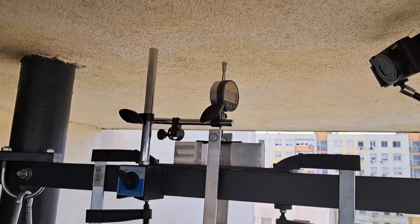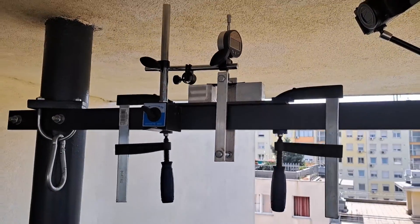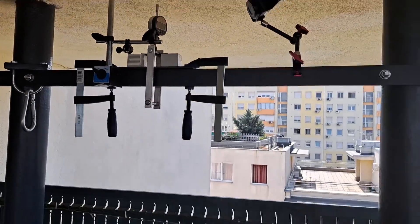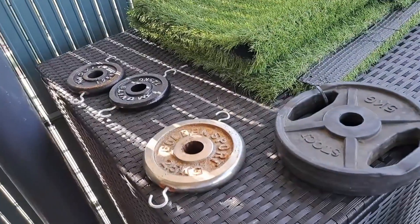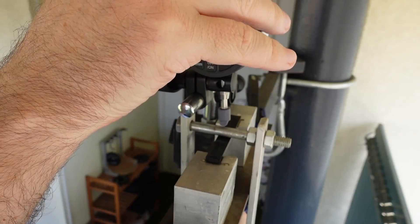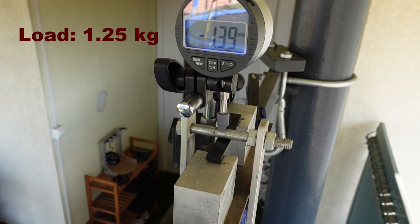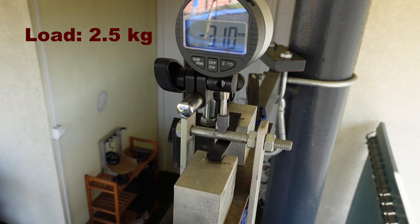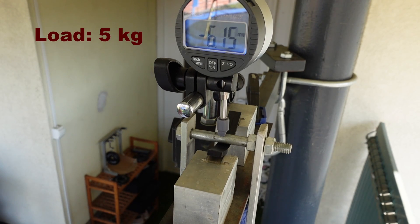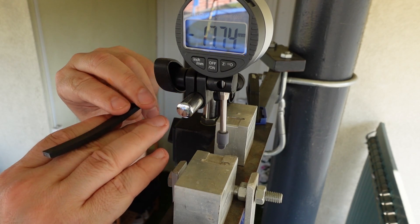This is my three-point bending test with a distance between supports of 50 mm. I want to measure the deformation after 1, 30 and 60 seconds. Here you can see the loads placed one by one. The deformation under 1.25 kg, 2.5 kg, 5 kg — and it failed under 10 kg. This is its permanent deformation after the test.